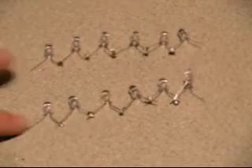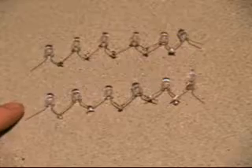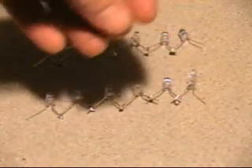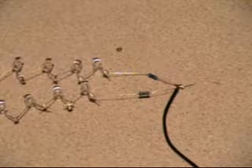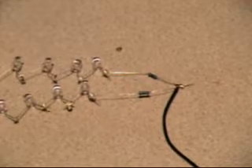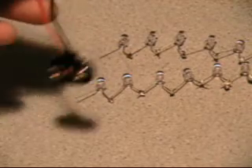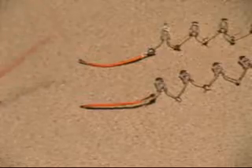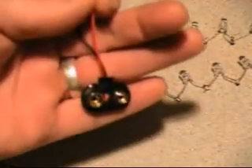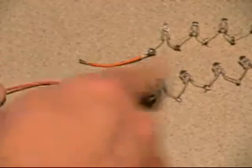Alright, now I've got all the IR LEDs and I've got them all soldered. It looks rough but we'll take care of that. Next I'm going to solder my 2 resistors into place. After you've soldered the other 2 ends, I'm going to make a jumper wire to connect it to my lead for my battery. Now I've got my 2 little jumper wires and I'm going to solder the positive side of my battery clip together with that, completing the hot side of the whole system.